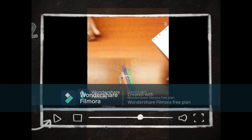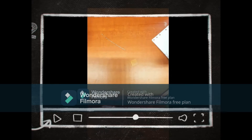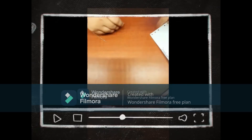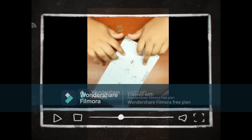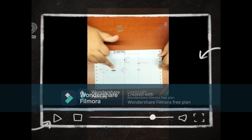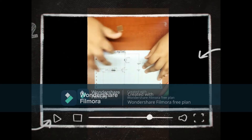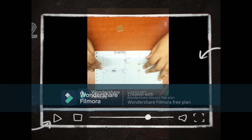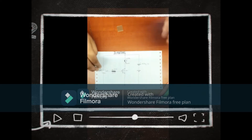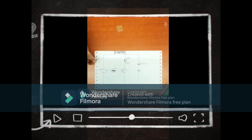Let's build the circuit first. Please keep your soldering iron on if you are going to make this. Before moving on, this is the diagram — you can copy it. This is the IC, this is the speaker, the resistor, the transistor, and one of the batteries. The positive side of the battery goes to the VCC of the IC, and the other part goes to ground.